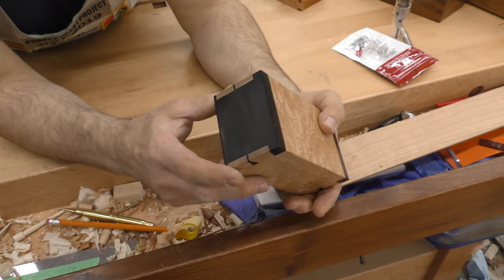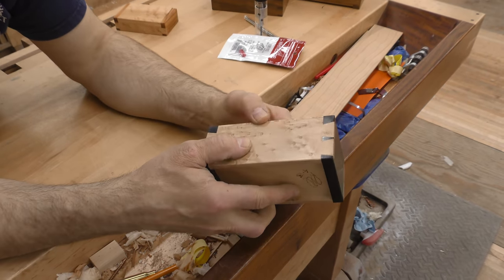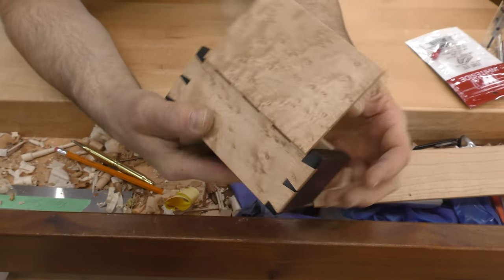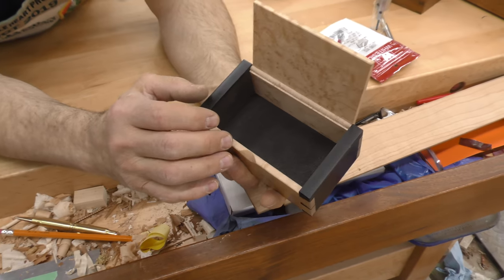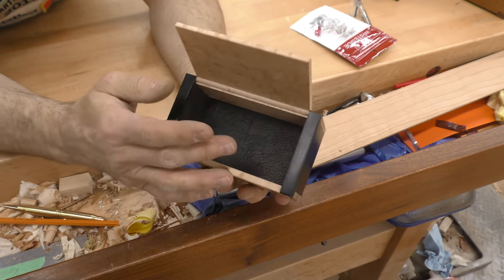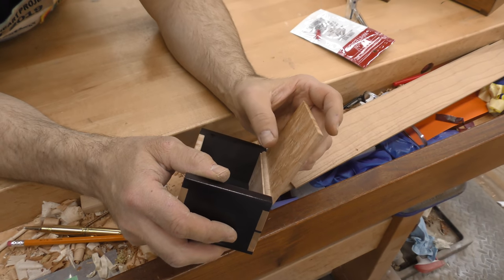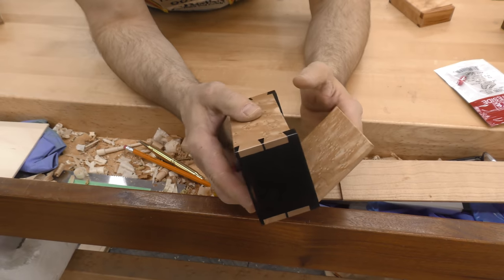This one is a little more complicated — made out of gaboon ebony and bird's eye maple, hand dovetailed, with a bird's eye lid. The dowel is also made out of bird's eye; you can see the bird's eyes in it. This is a seven-pin hinge. Really cool when it opens up. On this one the bottom is made out of Baltic birch, and I put leather on the inside — it contrasts nicely with the bird's eye and the ebony. I never put a finish on the inside because I don't want the smell. You have to finish the lid so that moisture absorption or release is the same on both surfaces — it won't prevent movement but it'll slow it so it happens at the same rate. You don't end up with a lid that cups half the year.